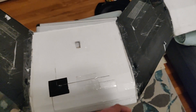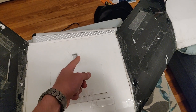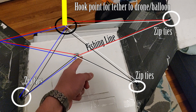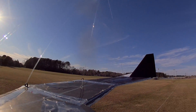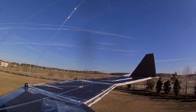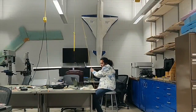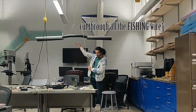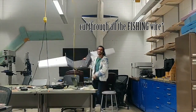I had four zip ties around the corners and then a nichrome wire in the center. I would send a fishing line through the zip tie and then hook it around the nichrome wire, bring it back out to the other corner, and do this for all four corners. Fishing lines can be in tension but not compression, but if you put them on all four corners they're always in tension and this doesn't allow for any rotation. Once we got to the predetermined height, the nichrome wire would heat up and cut through all the fishing line, releasing the aircraft.